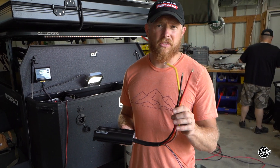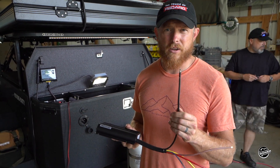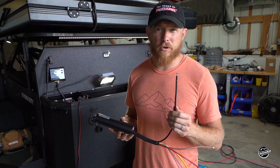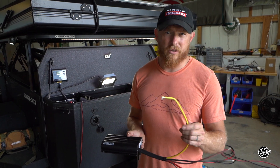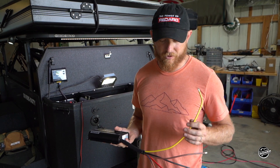We'll start with the thicker, bigger wires. You have the black, which is your ground. You're going to want to run this to your common ground. It is okay if you load ground it, as long as your load ground is also common ground. Yellow is going to go to your solar positive, and your solar negative is going to go to that same common ground.